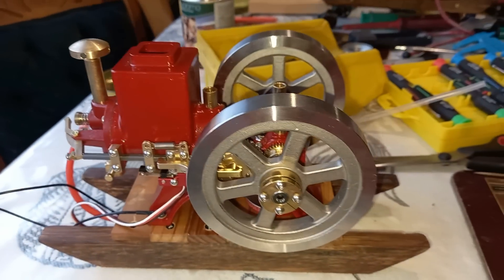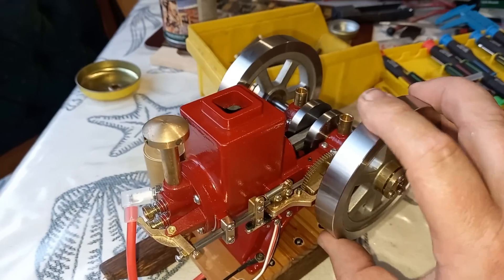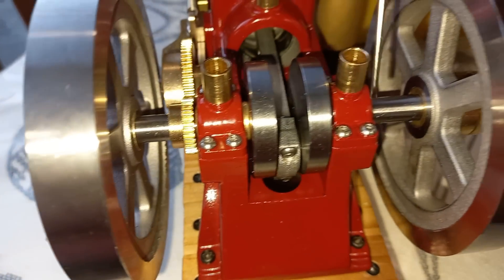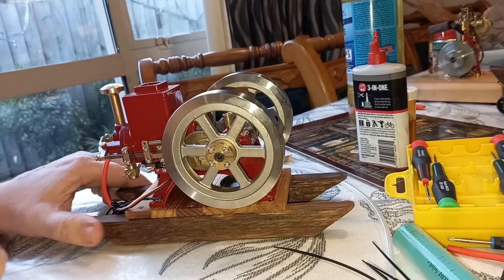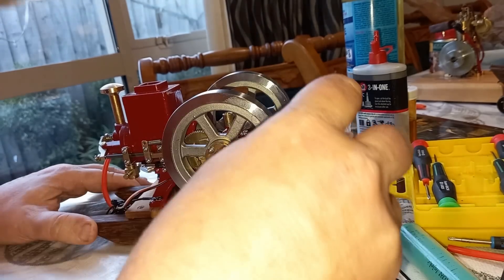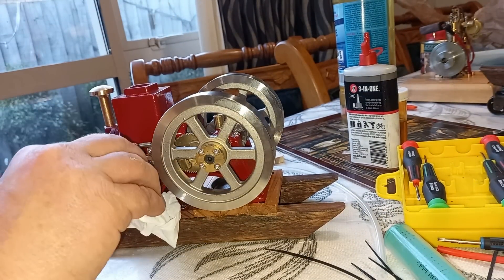I'm going to use three-in-one oil for my first couple of runs because I think that will help the engine run in — it's reasonably light and this engine's a little bit stiff. There's no wiggle in any of these bearings. I've checked — these are brass or bronze main sleeve bearings, which is exactly what you want in a hit-and-miss engine. I think I can feel something starting to go, but what I have done is managed to leak oil everywhere — a little bit enthusiastic with the oil. I'd rather too much than too little.